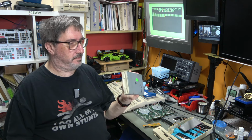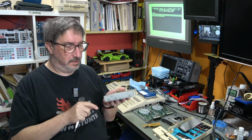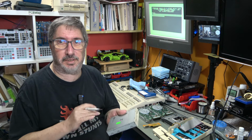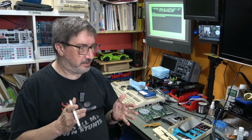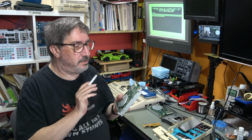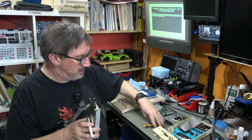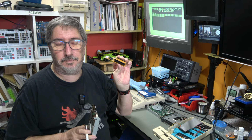On most of the drives, this Techmedia is one, for example, that doesn't matter. There is a pull-up. If it uses that density select line at all, there is a pull-up inside the drive. Remember, all these connections are open collector. They need a pull-up. But I suspect with these Samsungs, pin 2, and it's this one on the end, pin 2 is not pulled up internally and it's left floating. And this interface leaves it floating.